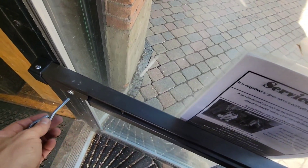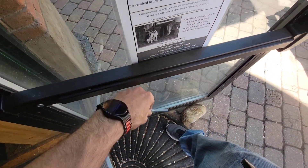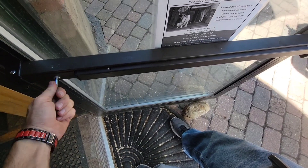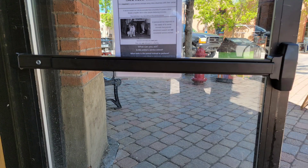To dog it down, you just push the bar in and turn the Allen head key — it stays unlocked. Turn the key back and give it a pop and it opens right up. Here's the exit device fully mounted and in place.